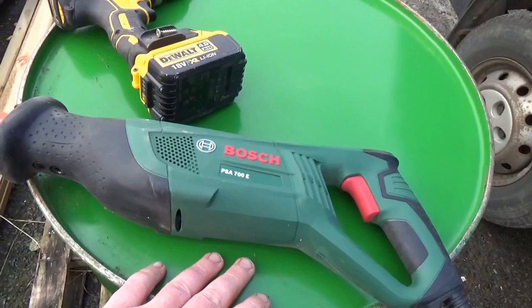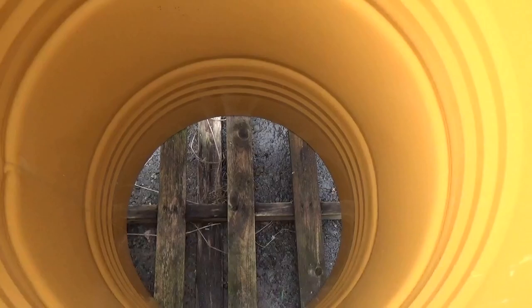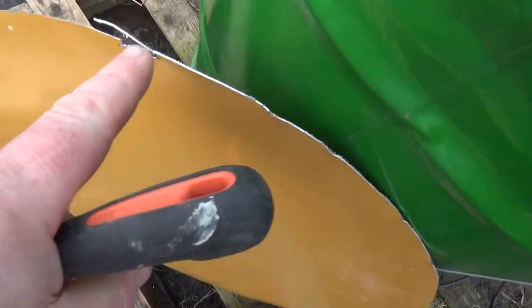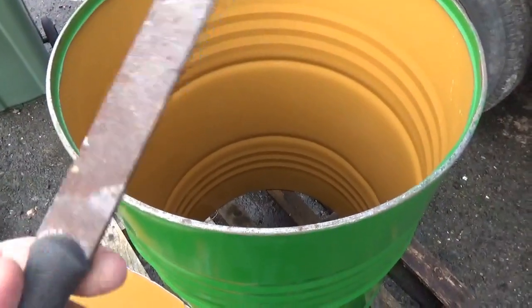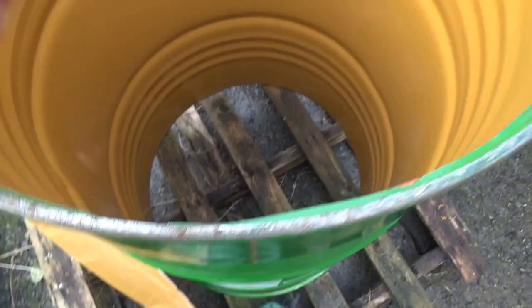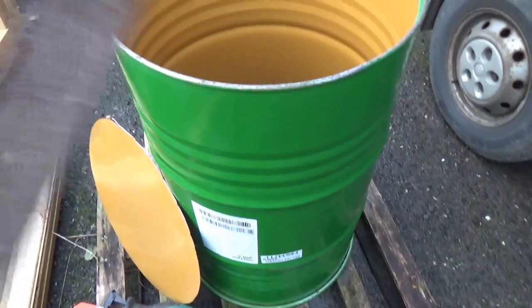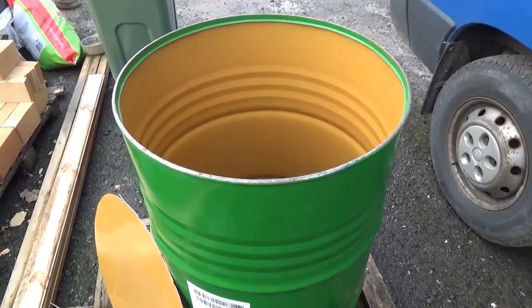I've got all the safety gear and ear defenders because this is going to be really loud — it's going to act like a drum as soon as I start cutting. That went quite well — it's now a hollow tube. There's the bottom, that's just where I took the drill in to make a few holes and then started the cut. That worked really well with the metal blade. Now I'm going to use a file and go around the edge to take off any burrs, otherwise I'll shred my hands every time I pick it up.